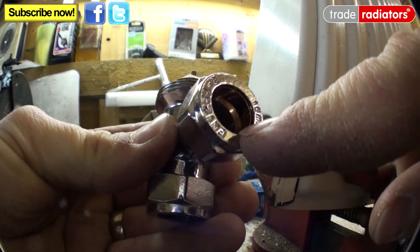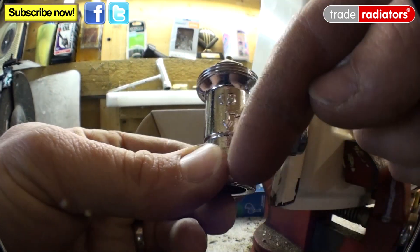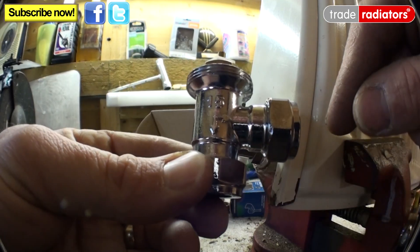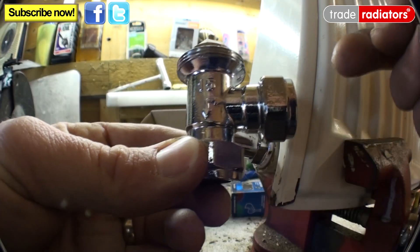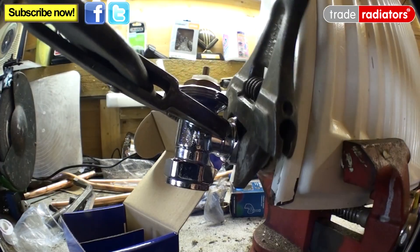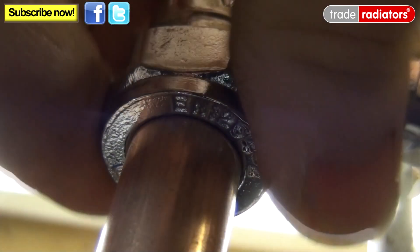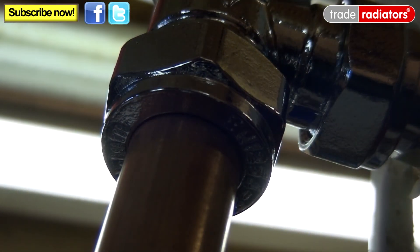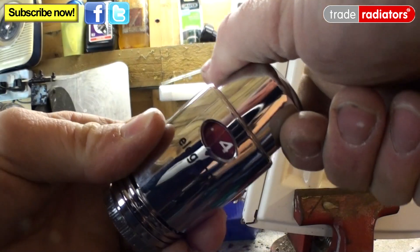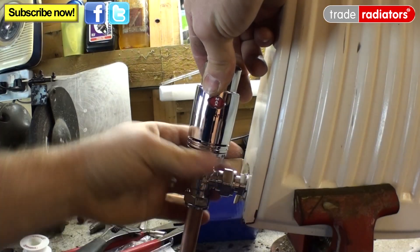You'll see inside here we have a nut and olive compression fitting, and also a nut and olive compression fitting on the bottom. Take note that there is an arrow pointing down here and also down here — that denotes this is a universal radiator valve, meaning you can put it on the flow or the return of the radiator. This makes it easier for people who don't know which is the flow and the return; they can put it on either end and it won't matter. Use a pair of grips and an adjustable spanner to tighten it up, and the same goes for the 15mm pipe going underneath. Pop that into the bottom of your radiator valve and tighten that up. Once that's on, make sure the thermostatic radiator head is open to maximum, pop it on, and make sure it clicks down. Then use the collar thread to screw the thermostatic radiator head to the valve.